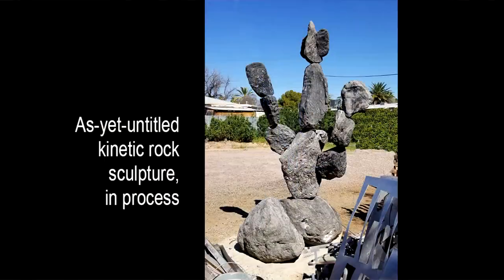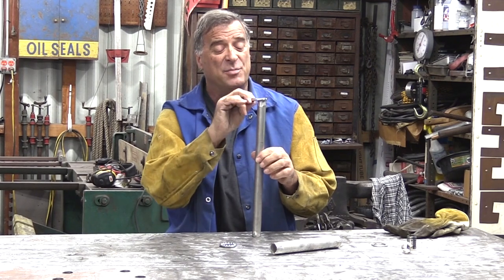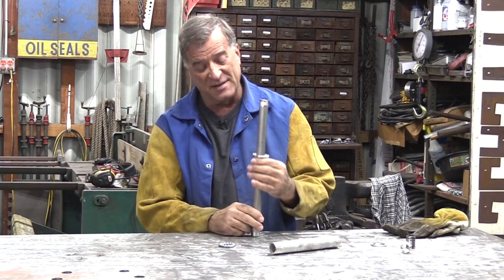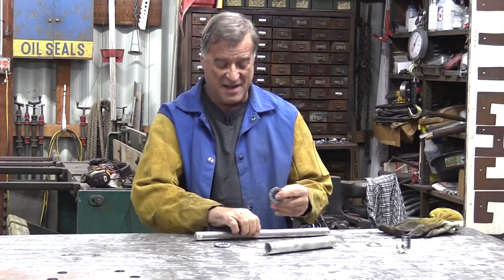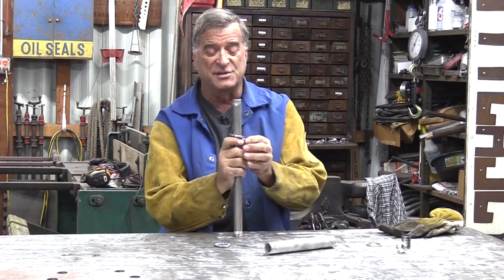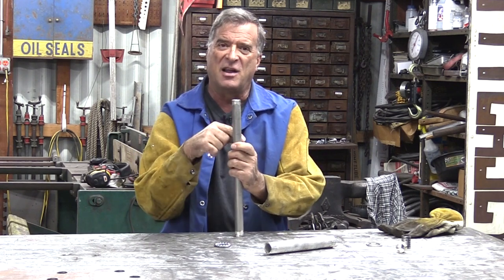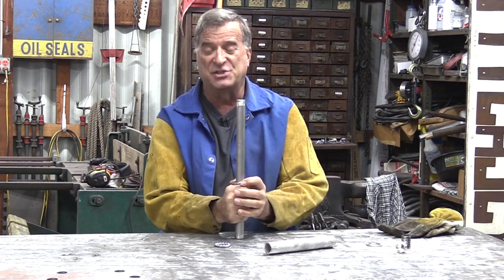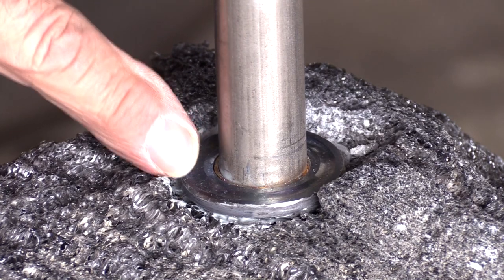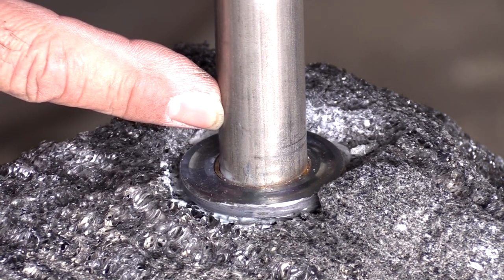The way I do it, at least with this commission, with this project right here, is I'm going to take that solid one-inch shaft. I'm going to put that race right over the top of it and get it wherever I want on the shaft. Then I'll come to the backside, get everything flat and straight and true, just the way it's supposed to be. And then I'll just come on the backside and tack that on there. Now the race — the lower race, if you will — is now captive on the shaft. And, of course, that's what we're seeing right here, is the lower race on the one-inch solid shaft.